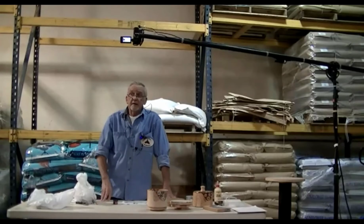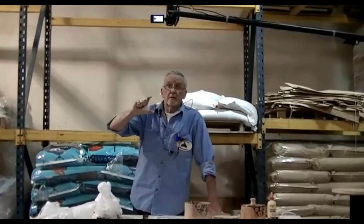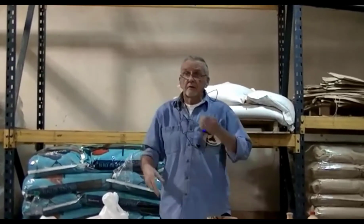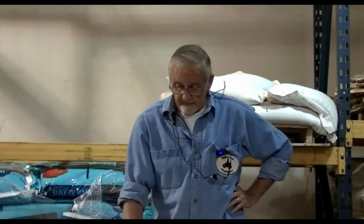For a long time, I've been going, like probably some of you have, down to True Value and taking a little bottle. You walk in there and you can buy for a couple bucks, $3 or $4, whatever it was, tinting that they use to mix paint with. However, not that I've ever done this, if you mix a little bit too much in your epoxy or your resin mix, in other words, if you get the clear and mix it up in there, if you mix a little bit too much of that in there, it will not dry. It stays pliable until the cows come home, period.